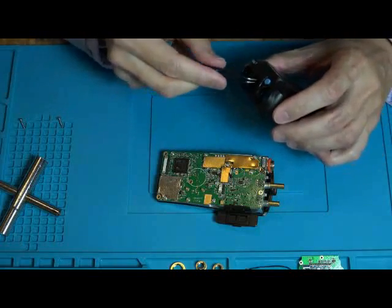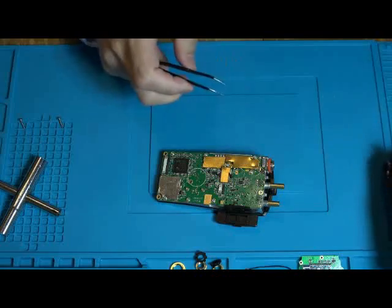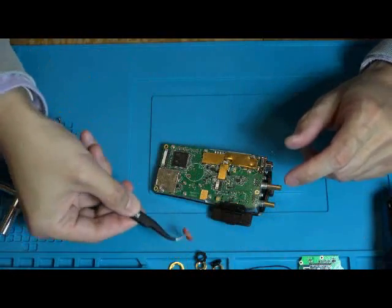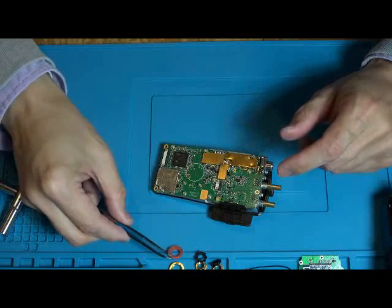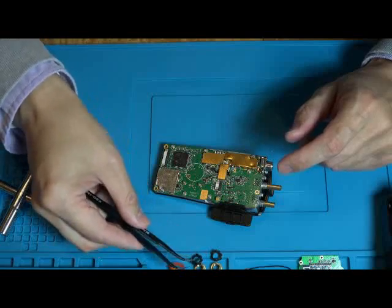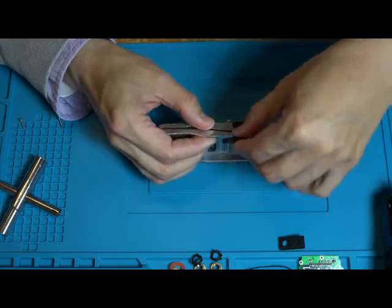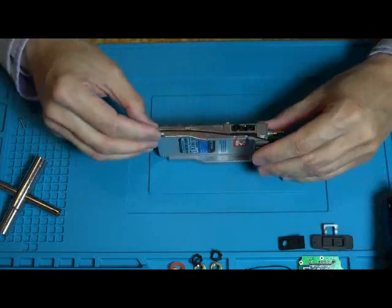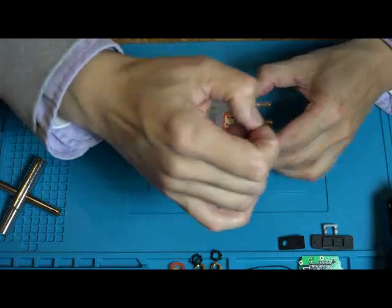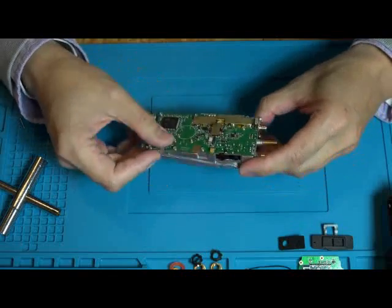Nice job. These are black washers — these are dust seals. They go underneath the volume control and channel selector knobs, and that is a seal for the antenna, so these are all dust seals. The black washers for the volume control and the channel have particular locking knobs on them — they have to go into slots that are inside the case of the radio. There's a flat top and then it goes up. That is the dust seal for the speaker mic. He's getting the cover for the speaker mic out of the way, and then he's got to pull the battery connector clip off. This is the O-ring that goes all the way around the metal case — you remove all this stuff so it's out of your way and you don't lose it when you're working on the radio.